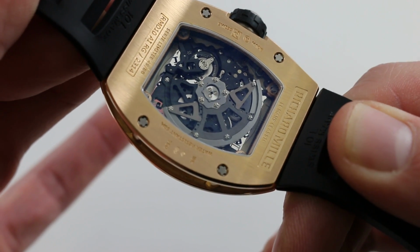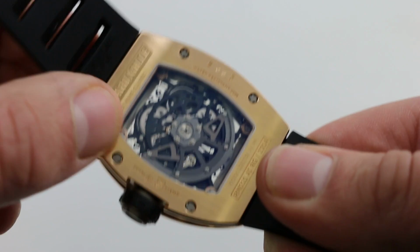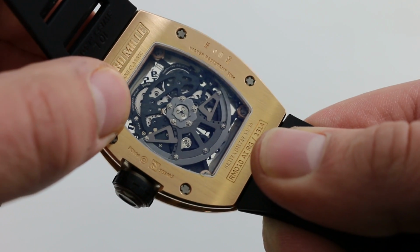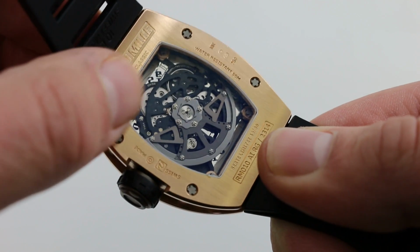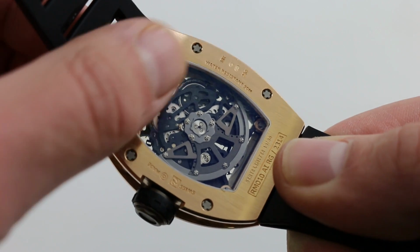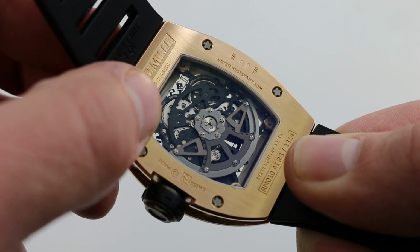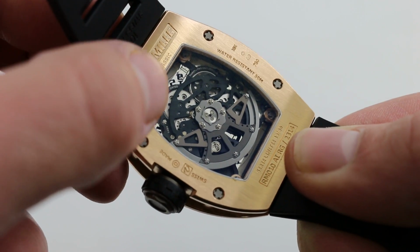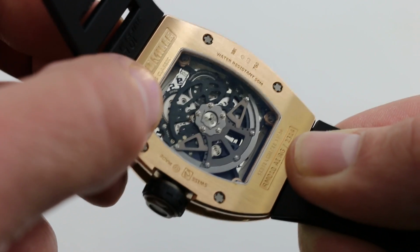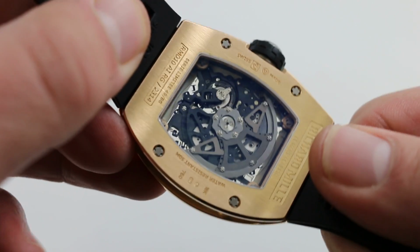Now, the watch does have a 55-hour power reserve, courtesy of twin mainspring barrels, which you can see through the skeletonized barrel bridge. They provide a very even release of torque throughout the 55-hour power reserve. So while ordinarily double mainspring barrels are used for outlandish power reserves, here they're used to provide excellent chronometry through the power reserve that's offered. And at 55 hours, it's still solidly more than the industry standard 42.